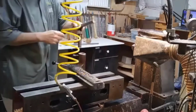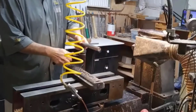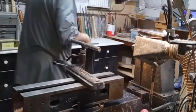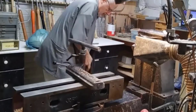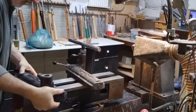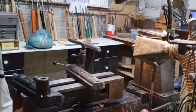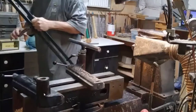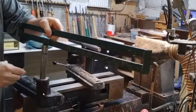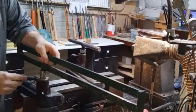And there's others too. Basically, though, here I am adding my threaded tool post. It's a 1-inch diameter threaded rod with eight threads per inch. Now the Jameson system comes with a post, a tool post for the backrest, which it's called the backrest. But my lathe comes with two banjos, so I just prefer to use the banjo. It's a heftier machine. It's easier to adjust like that. This is the backrest. Goes in there, slides down to that ink drawn line, and I tighten it there.